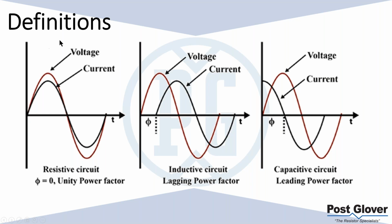is that when I say real power, and we don't need to get into all these different terminologies like power factor and everything, basically you are always going to have positive power, and you're always going to be giving off energy. Power is literally just a multiplication between voltage and current. With resistive power, you're always going to have the voltage and current phases in sync. Not to get too weedy here, but if you get two positive signals, you multiply those together, you get a positive value. If you get two negative signals, you multiply those, you also get a positive value. So the power is always going to be positive, you're always outputting power, and therefore you're always burning energy.